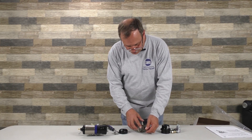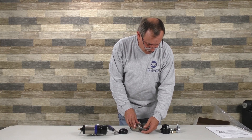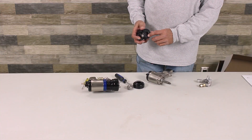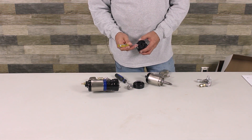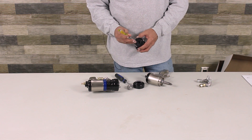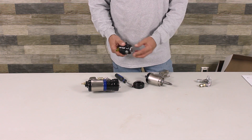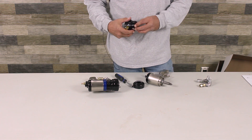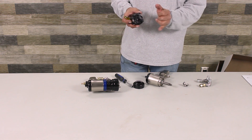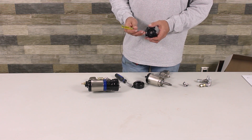There's an O-ring in the front of this gun. There's an O-ring right here — this black part here. If it's damaged, do not use it because you're going to cross the gun over. What happens is that little O-ring sits in there, and as your mixing chamber goes in and out it goes against that. As it goes back forward to stop spraying, that O-ring can come out. If it comes out, the mixing chamber falls just a tiny bit — just enough to where material leaks out from the side seals — and you'll have a crossover. You might get three or four trigger pulls and then you'll have a crossover.